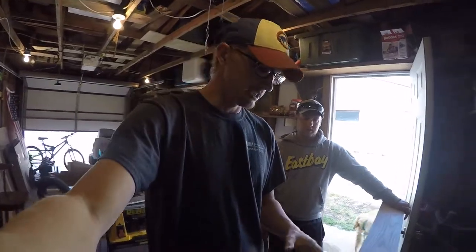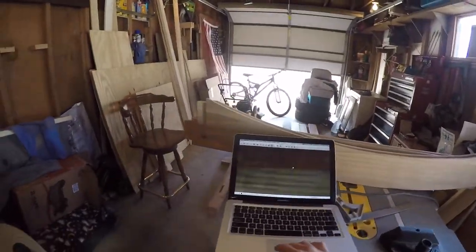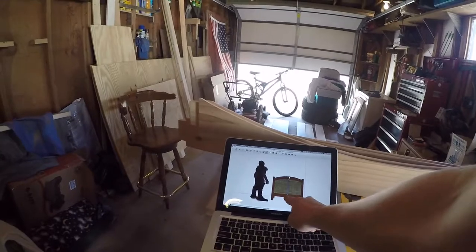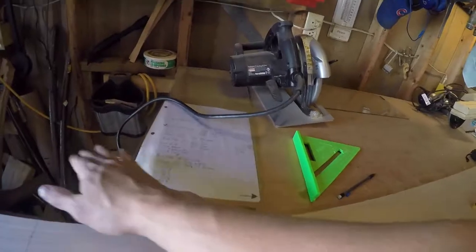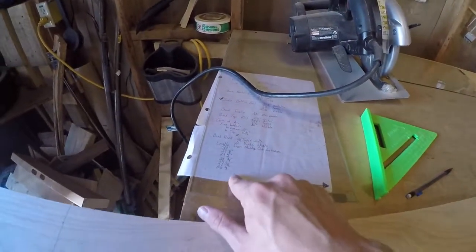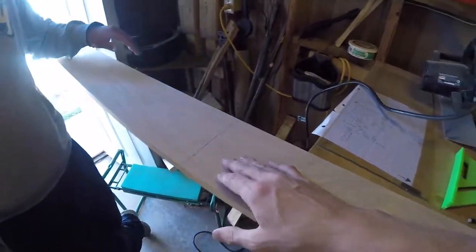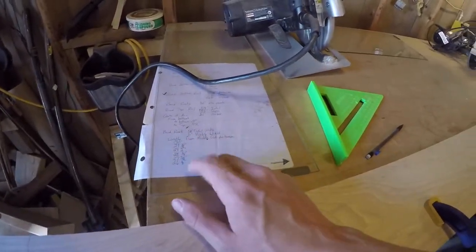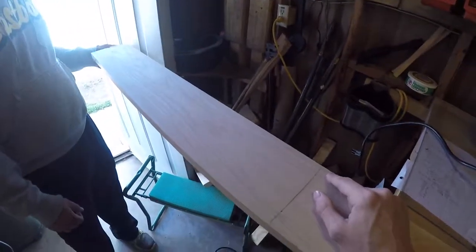So what we're doing today is we're cutting the back slats to start off. I've measured them out and referenced my drawing here — it's a little confusing, but we measured from the center points of each slat going outwards. So 30 inches is from the top to the bottom, plus the tenons which are about a half an inch. We've already marked the first board and we're going to cut all of these just straight across right away.